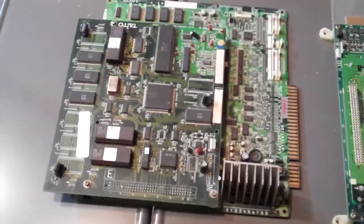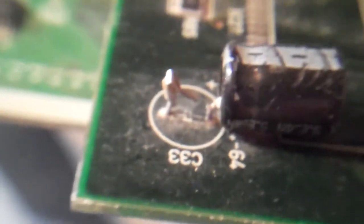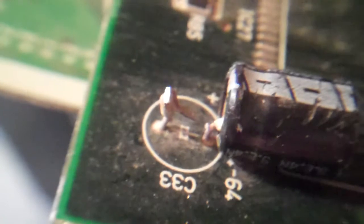The other board I got here — I think it's called Psychic Force — and this one has some issues. When I got it, the person said it'll work when it's flexed. I haven't really done anything to it yet, but I did find that this capacitor right here has its leg ripped right out of it. I have another one I could put in there, so I'm going to replace that capacitor. The other thing I noticed is that this board is really covered with some kind of residue — it looks almost like it was in a flood. Those stickers right there are supposed to have some text on them.